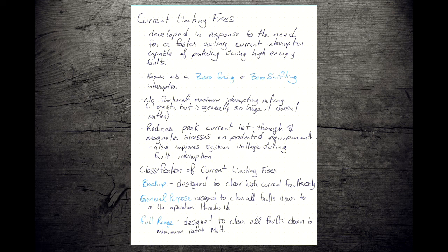through. So, we talked last week about how there's 2 big killers involved for our transformers when we have a fault. The first big killer we get is a magnetic effect, where the big current surge results in a big magnetic field, and the transformer will try to literally wrench itself apart. Cores get ripped off bases, coils crush down and destroy their own insulation. Leads get ripped off of bushings. All kinds of bad stuff can happen because of these strong magnetic fields.